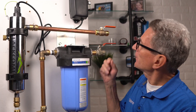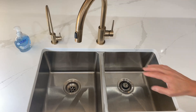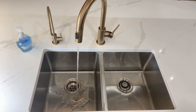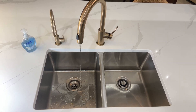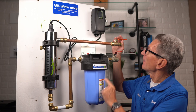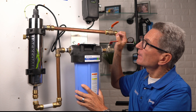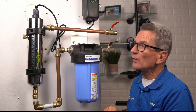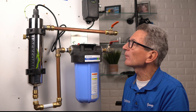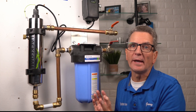The water flows in through here, so you're going to shut off the inlet. Now you're going to need to release the pressure. The easiest way to do that is open up a faucet anywhere in the home and let the water run until it slows right down to a trickle. Once it's slowed down to a trickle, then you can shut off the water going from here — that's just to make sure all the water from the whole house doesn't drain down through. Then you can push this button up here to release any pressure that's still remaining.